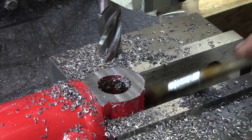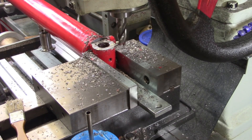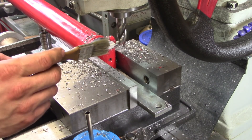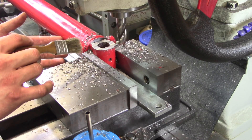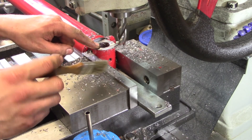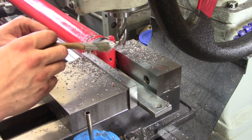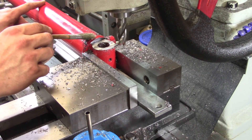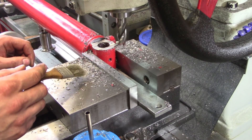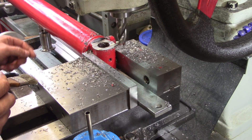So this is basically what I need to do to the other three sides of the rod ends. I just finished the last pass on the last face and it worked out pretty well. One thing I wanted to mention: I had it set up so that when cutting the initial faces, the end of the cylinder was touching the bottom of the vise. This piece here is 375 thousandths — three-eighths of an inch thick — and by sliding it underneath the part before tightening down and double-checking parallelism to the table, I could leave my jack at about the same height between machining cylinder faces. Thanks again for the jacks, Phil and Pierre — these things are awesome.